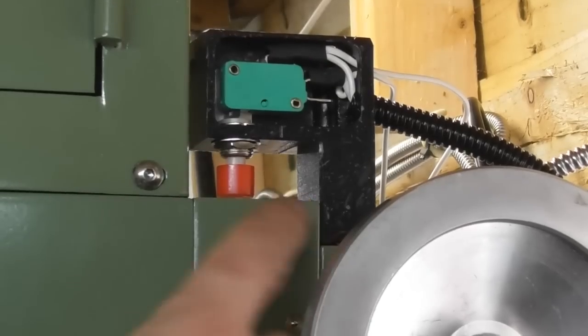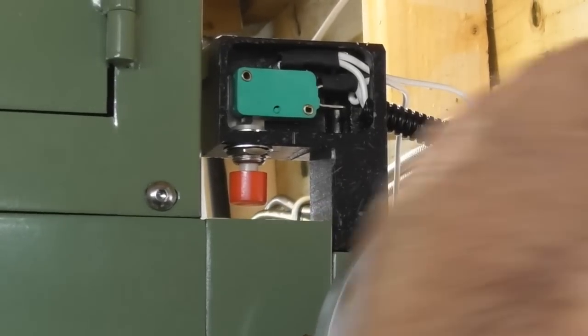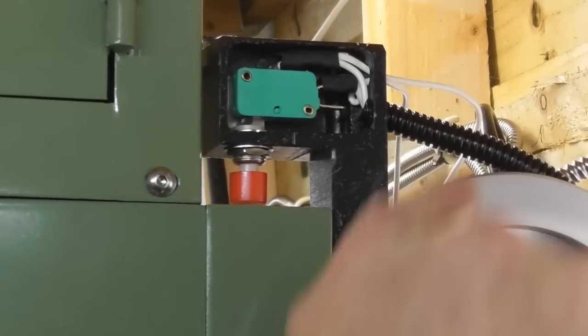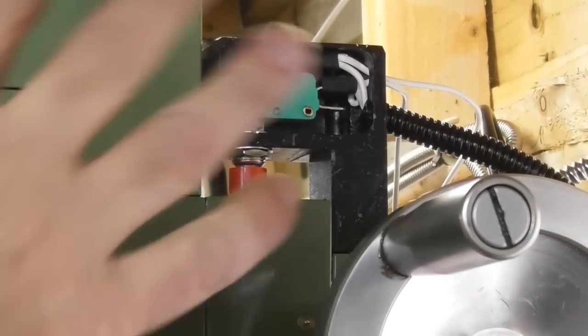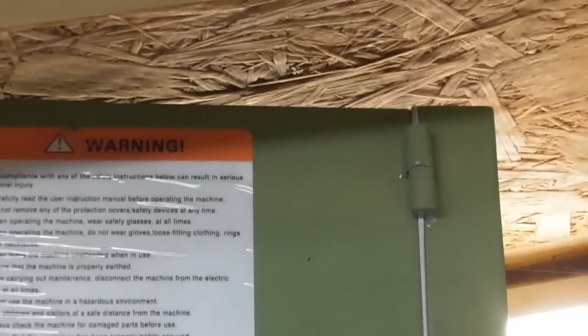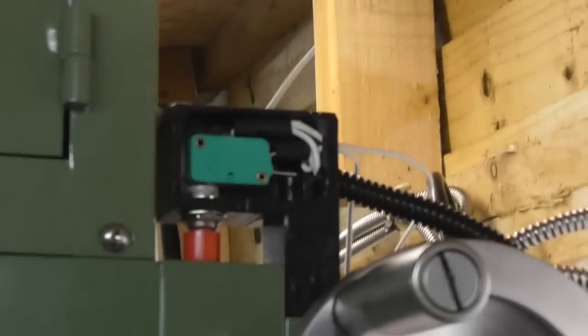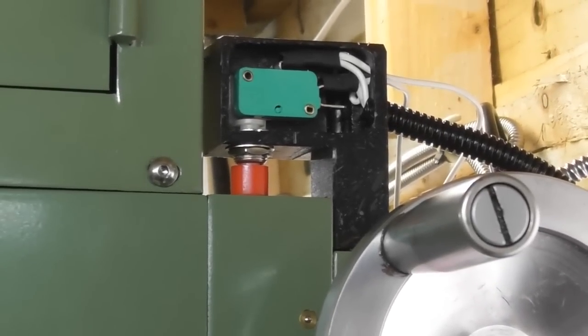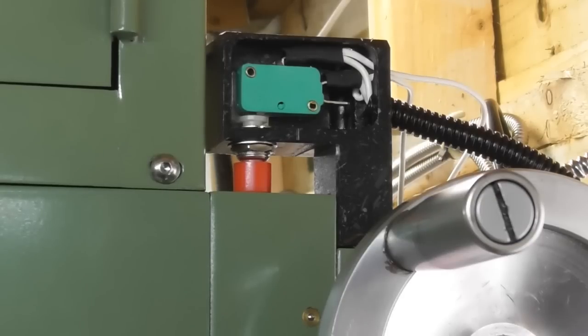There's the part I was machining in place. The hole up through there — there's two holes in the back. It's a machined block with a hollow in it, with a hole right down through it, and it picks up on one of the existing bolts on the top of the mill. The idea is that when the mill comes up under power feed, you hear a click and it cuts out. There's a little bit of room — maybe 5mm left on the DRO scale before it tops out, and probably about 8 to 10mm on the ceiling of the shed. So that's basically to stop me over-travelling the head. If I turn around or the phone rings and I'm under power feed, the feed will go up — if I'm not looking at it, it'll cut out at its top position.